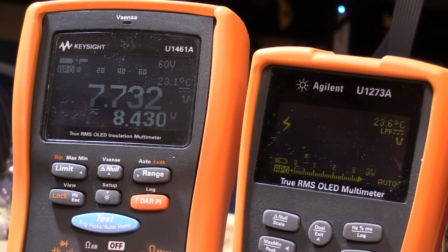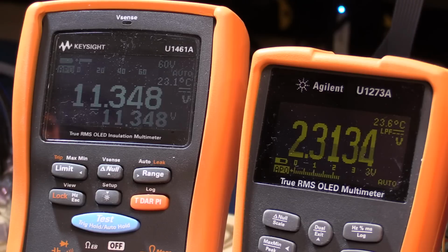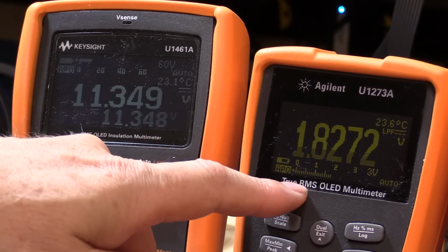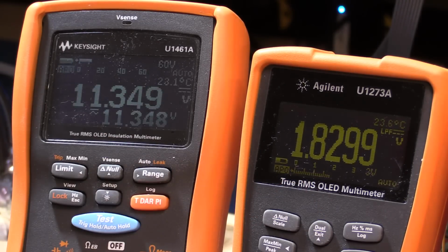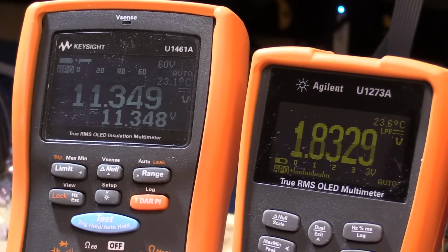If I actually put the output to a DC instead, like there, and I'll take that up a little bit to increase the current. So now what we've got is you can see that the current is now pulling down the MOSFET, turning it off, because I've reduced the current down to 0, which means it's basically trying to turn the thing off.